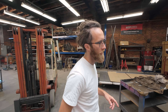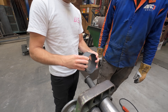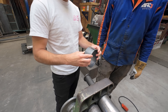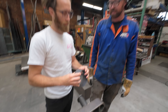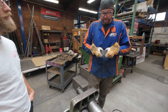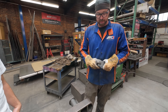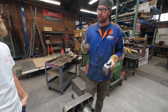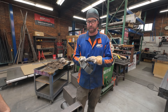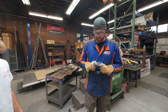I have a question — so yours is pretty close here. How do you fix it if it's off a little bit like that? Bend it. If it's quarter inch material it's going to be hard, but all this eighth inch stuff, you just kind of wrestle it smooth. And then let's say your weld was a little weird — tack it together, stitch weld it, grind it smooth, put it back in the roller, roll it some more, and then it can't go anywhere. It's just going to sit there and roll and you kind of pre-stress the whole thing. The weld line is a little harder than the rest of it, but nothing's perfect.